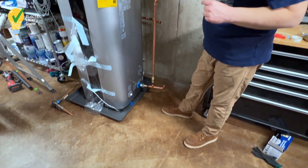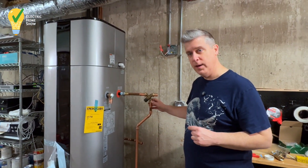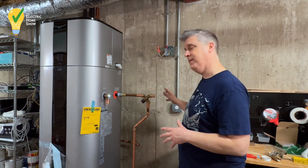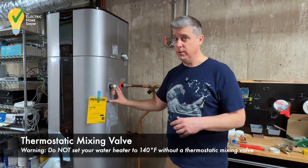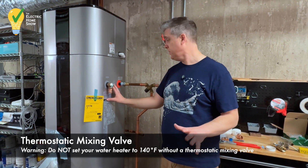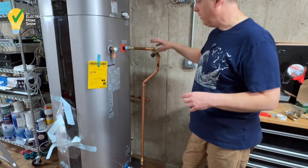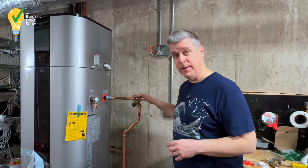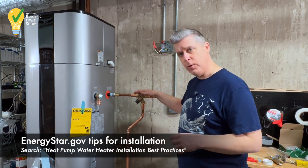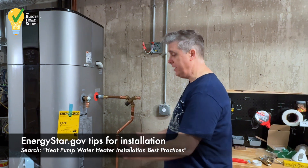What's going on is we've added a thermostatic mixing valve in between here. What that allows us to do is increase the overall capacity of hot water at the temperature we want. We can set this temperature up to 140 degrees Fahrenheit, but we don't want 140 degrees Fahrenheit water coming out of our taps — that would be very dangerous. So we connect it here with a thermostatic mixing valve that takes the cold water, mixes it with that 140-degree temperature, and then we can dial in the temperature that we want to go to the rest of the fixtures. This is recommended by the Department of Energy, and it's also going to increase the capacity of how much hot water we have. So this is 80 gallons.